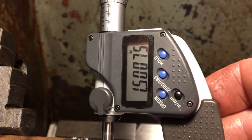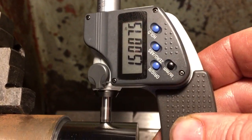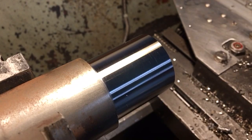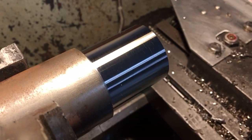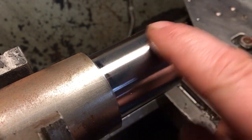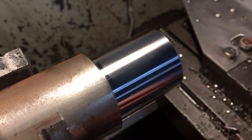According to this we are plus seven tenths, which is the kind of thing we like. You could polish that very slightly and be well within your tolerance of plus or minus a thou. In fact within half a thou — if you just polished that very lightly you'd have a really nice finish and be a few tenths over size, and nobody's going to complain with that.